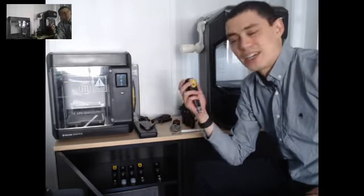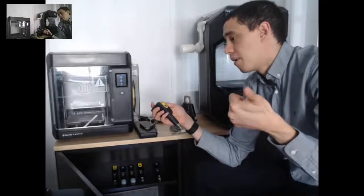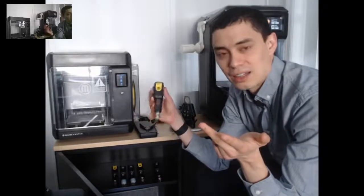So I would say stick to individual extruders, at least for every single material family. And what I mean by that is standard polymers, think about PLA, PETG, even nylon, single extruder, usually extruder number one. High temp polymers, say ABS, ASA, and the like, would be extruder 1XA. And then you can have one for composites, so for nylon carbon fiber, ABS carbon fiber, ABS Kevlar, and so on, which could be the 1C extruder or just a Labs extruder. The Gen 2 will take that, no problem.